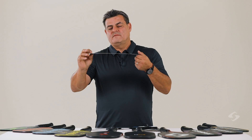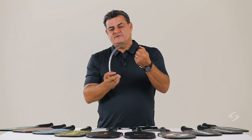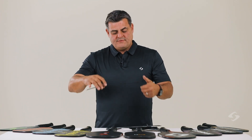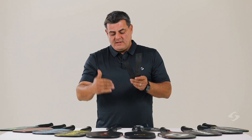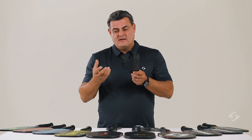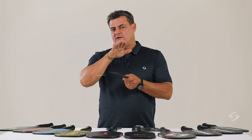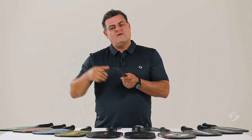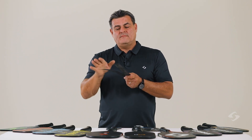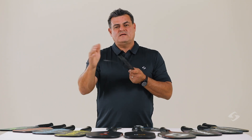So again, this is zero degree — very stiff, same material — look at that amount of energy going back. Thirty degrees, very soft. That's essentially how we work with 200 different plies through the structure, molding it by placing these at different degrees. We can go anywhere between zero all the way to 90 degrees, and a combination of that gives us tremendous design ability.